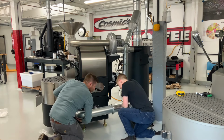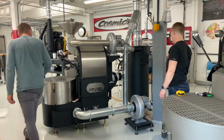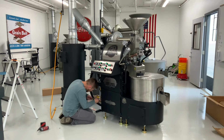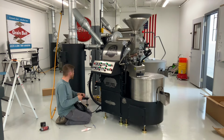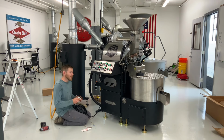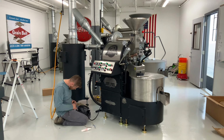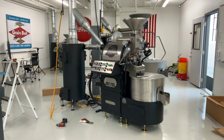Even after putting all the silicone sealant on everything, reattaching everything was really easy because we had already done a complete layout and the spacing was already perfect. Here you see Alex installing a locking plug to work with the locking receptacle that we already had in the spot from the previous 6 kg. When you install a machine, your electrician will be a good resource as to whether you can or should install a locking plug or receptacle, or if you should hardwire the cord of the unit into a junction box.